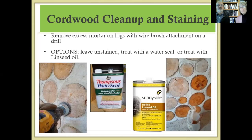The other thing I wanted to say, forgot to mention, with the sealing around the logs with the spoons that we did, the mortar dries slowly typically. It depends on the humidity in the air, of course, and how sunny your days are, and how quickly it will dry. But we found that it was good to wait a little bit after setting the logs before going back and sealing around each log with the mortar and using the spoon to do that.